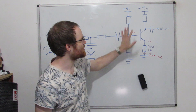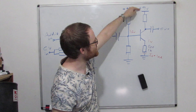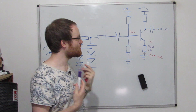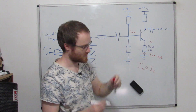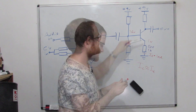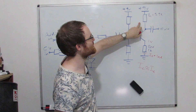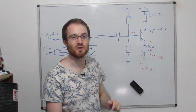This is a little different from last time. Last time we wanted to center the output taken from the emitter, so we set the bias voltage so that bias minus VBE would center the output. This time we want the emitter point nice and low because we can only swing from just below 9 volts down to just above the emitter voltage — so this gives us about 8 volts of swing. With the emitter current of 1 milliamp approximately equal to the collector current, I'll pick the collector resistor to center the output in that range, setting it to 3.9k — the nearest preferred value to 4k. With no input, 1 milliamp times 3.9k gives about 4 volts drop, so the collector sits at 9 minus 4 equals 5 volts — nicely halfway between 1 volt and 9 volts.